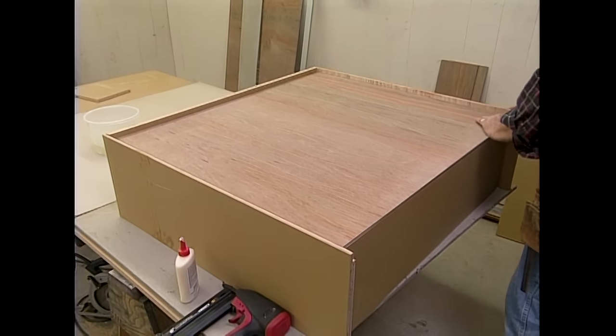Here I've set up the dado cutter again and I'm plowing out material in these 2x4s to make half laps for the fixed top on the cabinet. Some glue on the half laps, then I'll secure the joint with some 1-1/4 inch screws. I just take the frame, sit it on top of the carcass, pre-drill some holes, and attach it with some 2-inch screws. Now a piece of 3/4-inch plywood — just attach it with some brads. Now the piece of masonite just sits on top, and now we'll trim this edge with some more pine.